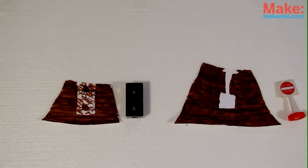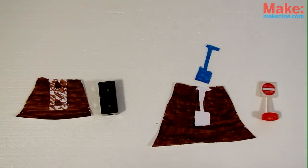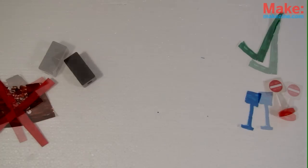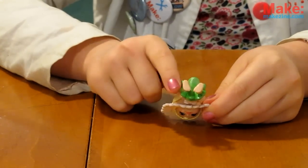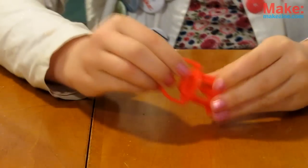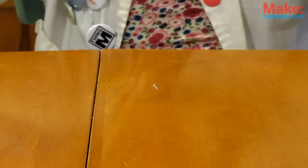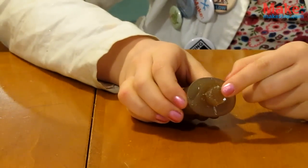Also, without a way for the air to escape during molding or casting, you'll be left with problem-causing air bubbles. And without good shapes or entry points, duplicating your toy gets a lot trickier. This doll's legs are too small to pour into. This toy lantern would end up locked in the mold because of the big hole in the middle. Our pointer finger copied great because it doesn't have any hooks or voids and has a handle we used as a pipe to pour into after molding.